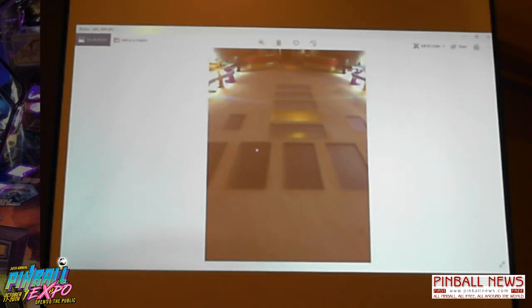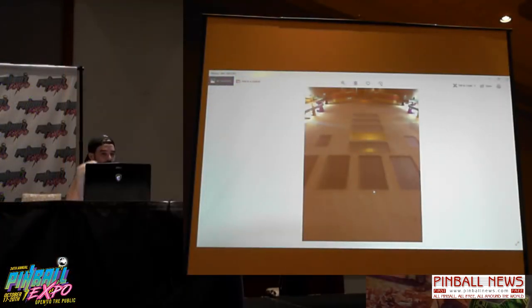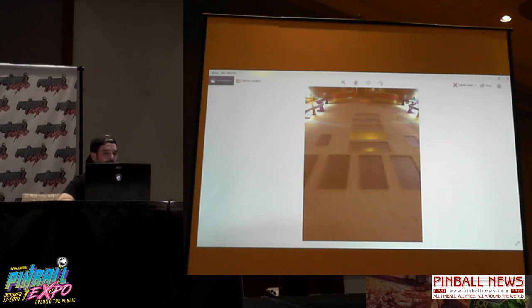These are a little out of order, sorry. For the inserts we used on the second whitewood, it was just one sheet of plastic that we lasered to fit the routing here, and they're nice and diffused. This is great, and we went with it. Then when we put clear coat on them, the inserts turned clear, and you can just see right through them. So that was a mistake, but yeah, it works. It's a lot easier than trying to buy off-the-shelf inserts.